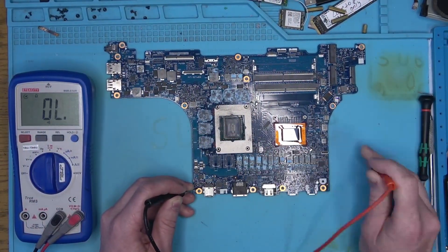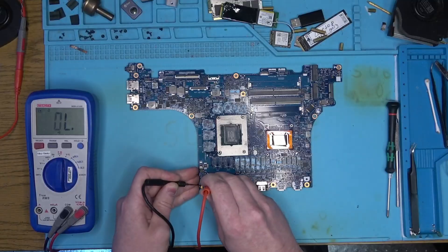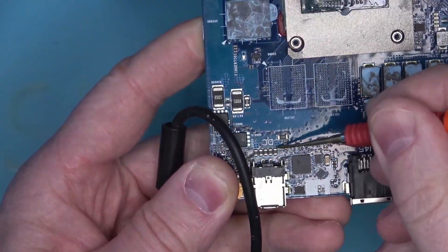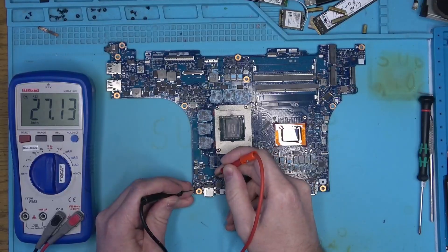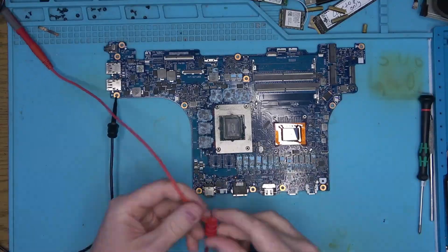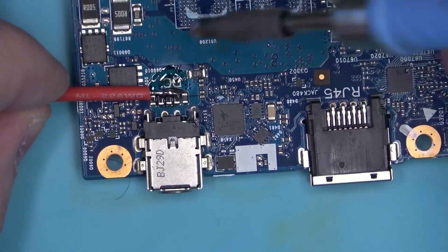Started with a basic sanity check, measuring resistances. I didn't find anything wrong, so the next step would be to figure out how to power this thing without the power supply, to monitor its consumption. Using my Chinese multimeter, after finding which pins are ground and which are not, gives me about 51% confidence that I narrowed down the pin I need to supply 20 volts to.